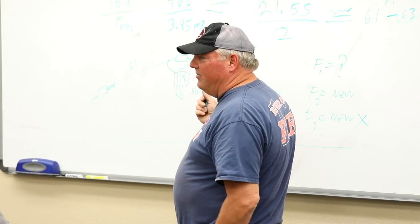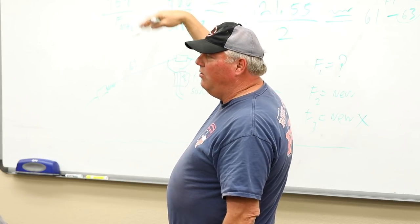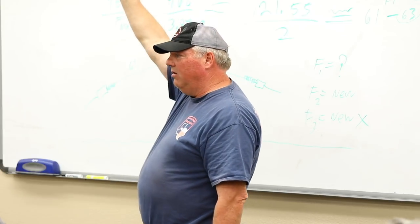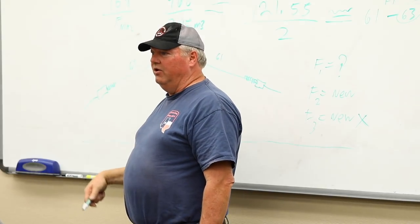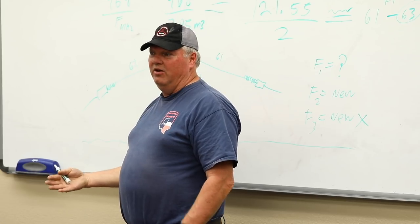Just like you said, when I went up higher, mine worked better. The reason is, if you can get your 80 meter antenna way up in the air and then measure it correctly, your match will be better. It'll be closer to 50 ohms. It'll be resonant and it'll behave.